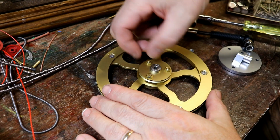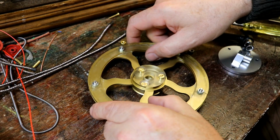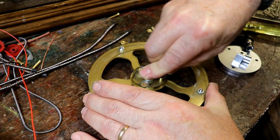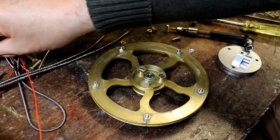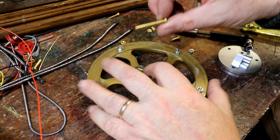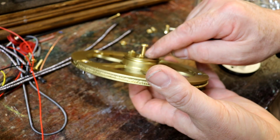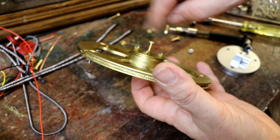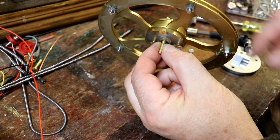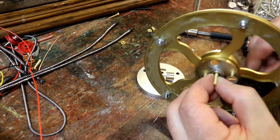So just like the phonograph drum cylinder, the bearings just push into the front and back. And what I'm using as a shaft for this is in fact an M4 screw. So it's just the right length, and because the thread isn't going to theoretically rub on anything, all the rotational support's going to be given by the bearings. It really doesn't matter. It's just going to stick far back enough to fit into that with the aid of a washer. Lovely.